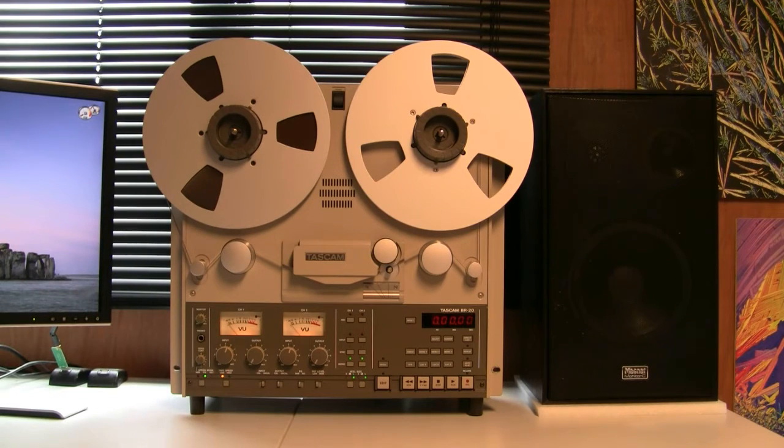I thought I'd give it a go and put it through — and after a very short period of time, wished I hadn't. Within only a few minutes I started noticing small flecks of black collecting at the base of the tape deck and the tape was obviously shredding. I only played it for maybe a few minutes and when I rewound it, it started squeaking. Luckily there was no deposit on the heads, but there was a small buildup of black flakes here and there, which was easily removed with a cloth and a quick wipe with isopropanol. I binned all that tape.